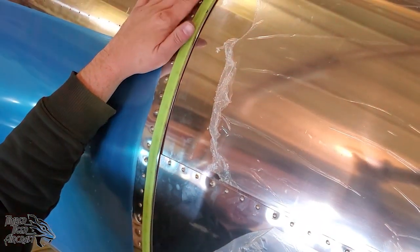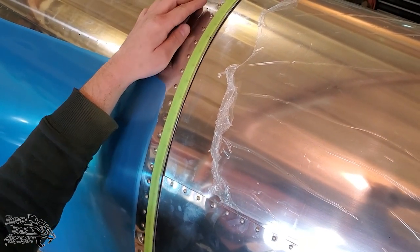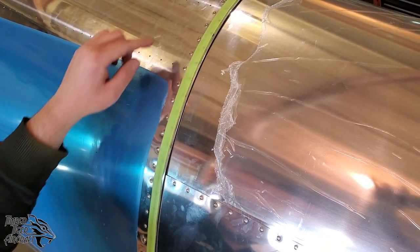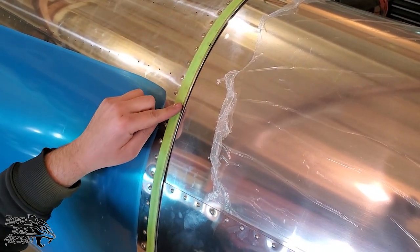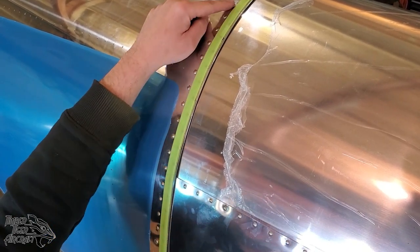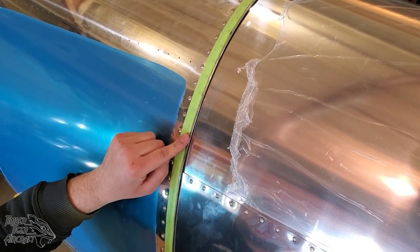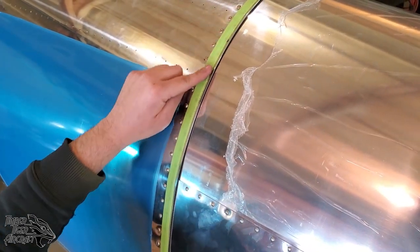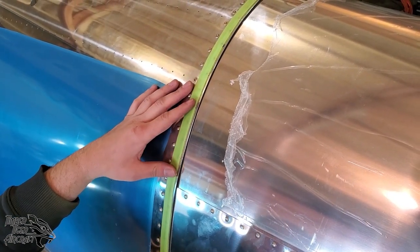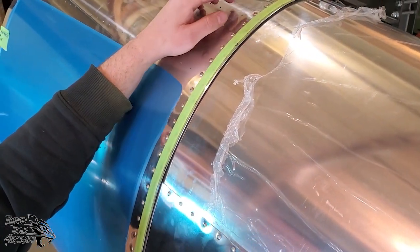We're working on bulkhead 4, and I wanted to take a minute to show you a little bit about moving this metal. So as you can see, we've riveted this front line completely. And as we said, you leave the second line drilled to the smaller size. You don't open it up to number 30 until this is completely riveted. So we riveted this, then we opened up all these holes to number 30. We took care of chips and burrs, and then we put in every single rivet with some tape. You want every single rivet in place. Don't skip any rivets right now, because if you do, your holes are going to start to misalign as you rivet every other one, and you don't want that misalignment.